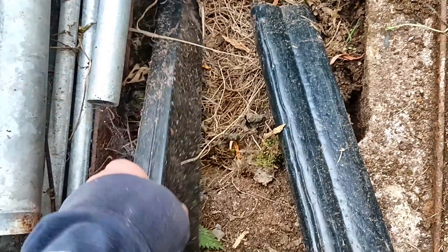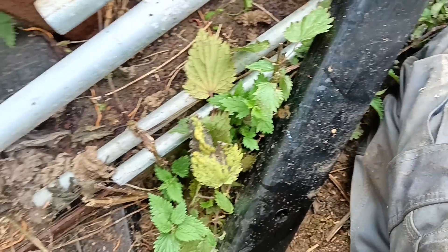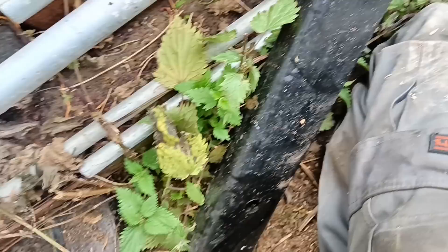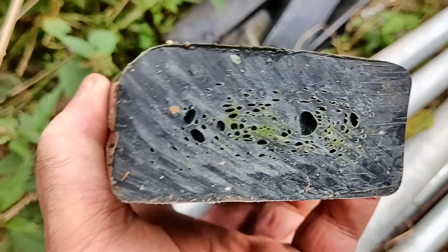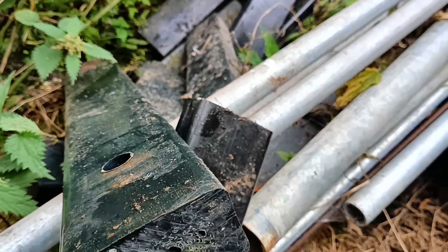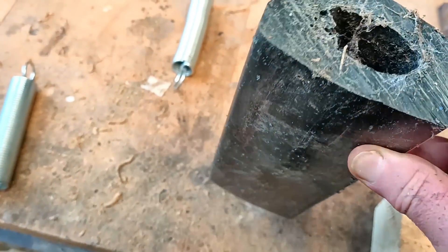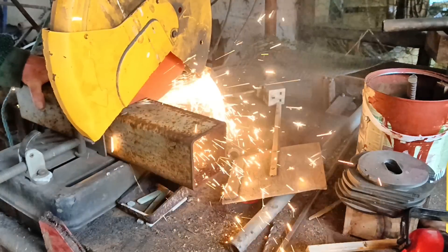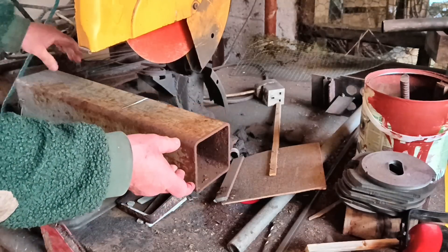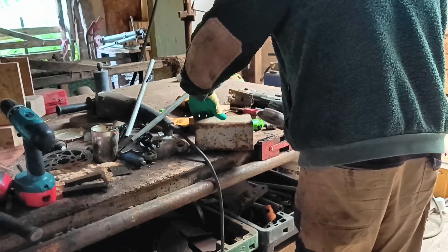So I set out to make my own using some already recycled plastic that I already have. You might recognize these as offcuts from the rail waste sleepers, which by the way are still in perfect condition. This was extruded through a tube — they heat up the plastic and force it in at one end and it cools down and comes out of the other, more or less the same shape as the inside of the tube, but it shrinks a lot as it cools and it often has voids in it. So can I remake it bigger and better? That's the challenge. My idea is simple: if the plastic is heated up slowly enough then the heat will get through to the middle, and if it's cooled down slowly enough perhaps it won't shrink too much or produce cavities in the middle. So worth a try, surely.